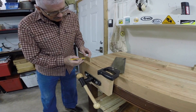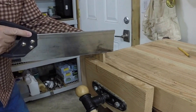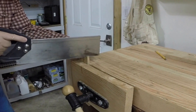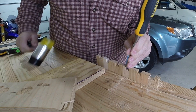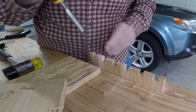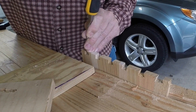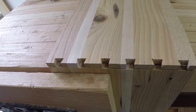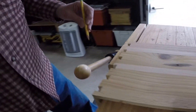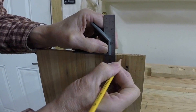The trick here is just to make sure that when you're cutting, you're always cutting on the waste side of the line — not on the side of the line you're going to try to save. I have my thumb sitting in there just to kind of rest the saw against it until it gets a little bit of a groove of its own. When you're dealing with the rest of the world and you just want to be down here cutting dovetails, it's pretty nice. After that number one panel's cut, it's just a matter of laying it on the other panel and lining that out. If you put your pencil where you want your line to be, then put your square on there and draw your line, your line is exactly where you want it to be.